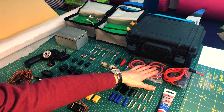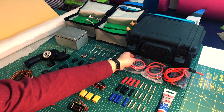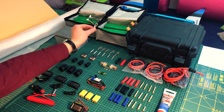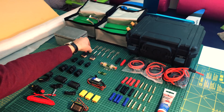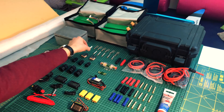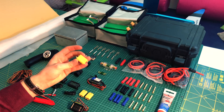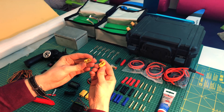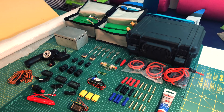The silicon cable is more heat-resistant and more flexible than polymer — really good quality stuff, and I've got four meters. Unfortunately they're packaged in one-meter lengths, which is a bit annoying. I've also got these connectors rated for a lot of amps, and these crimp tubes to connect wires together — easier than soldering. I plan to use XT-90 connectors from RC plane controllers, but they're only rated for roughly 120 amps. So mostly I'll use these XT-150 connectors, which are rated for much higher currents and just a bit beefier.